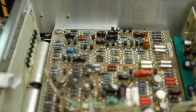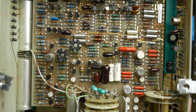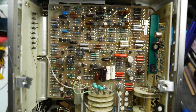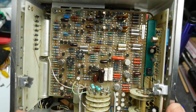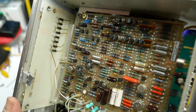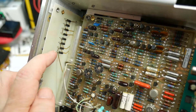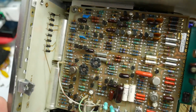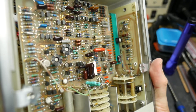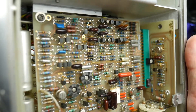So there's the inside of it. What have we got in here? Lots of discrete transistors, lots of discrete through-hole components — transistors, resistors, all the things you'd expect — on a printed circuit board. Now these printed circuit boards, even the power supply PCB which I think is this one over here on the left, they're all gold-plated all over. It looks like we've got several PCBs in here, and there's a green edge connector between one PCB and the next.